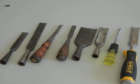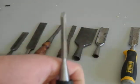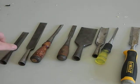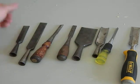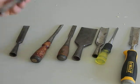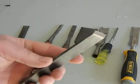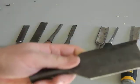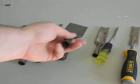So what you need is basically, you only need about 4 or 5 chisels. And primarily what you're going to need is something around a 1/4 inch, like this Harbor Freight here. You're going to want something around a 1/2 inch, which I think this one here is pretty close to. Something that's more along the lines of 3/4 of an inch, which I think this one is. Real nice chisel. Love this chisel. I use it a lot. And then a larger, maybe a 1 to 2 inch chisel. 1 inch is nice, a 1.5 is nice, maybe a 2. Depends on what you can find out there.